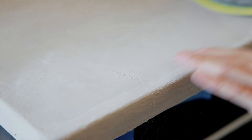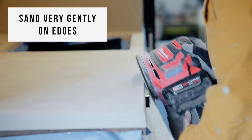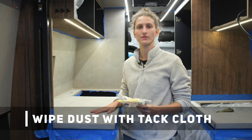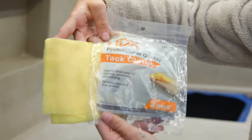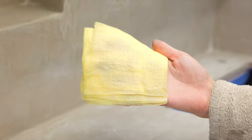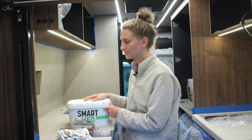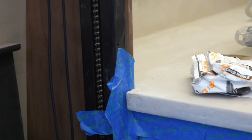Sometimes you'll get weird black ink spots. The best thing to do is scrape them out and cover them with more Liso. After sanding the first Liso coat, wipe down the surface using tack cloths — they're coated in beeswax and really pick up all the fine dust so your surface is fully clean. Now for the last coat, you do your second coat of Liso exactly the same way. With this one, try to get it relatively smooth since it's the final coat, and don't forget to re-tape all the edges before you start.